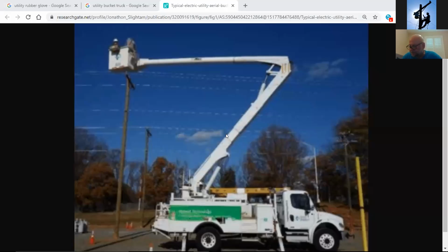Now, this is an industry standard for all fiberglass products in utilities. Sticks, fiberglass crimping machines, fiberglass cutters, fiberglass on booms. These are all rated to 100,000 volts per foot. So they have an insulation value of 100 kV per foot. So let's say that boom section right there is 15 feet. How much insulation do I have between the bucket truck and this part of the boom? 15 feet times 100,000: 1,500,000 volts. Okay, that's just this section of the boom.